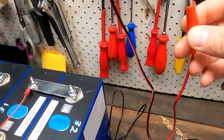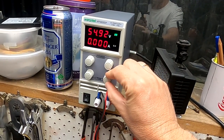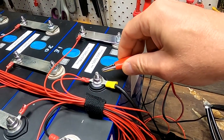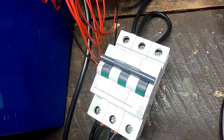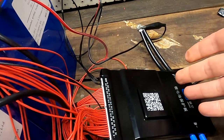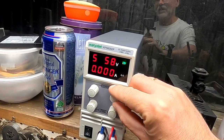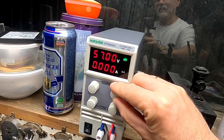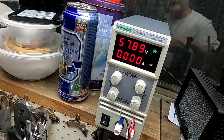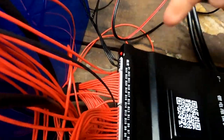Let's go with 55V — still nothing. Let's increase the voltage slowly. That should be at around 57, 58V. There we go — it beeps and the light comes on at about 58V — so 5V more than the battery — and the BMS turns on! I can disconnect the charger again and the BMS stays on. I'm not sure how to do this later when it's all connected in the battery rack, but we'll figure something out. Please leave your comments below — how do you start this BMS up?